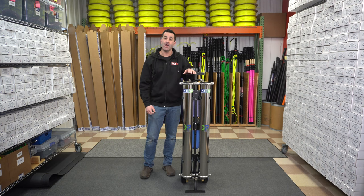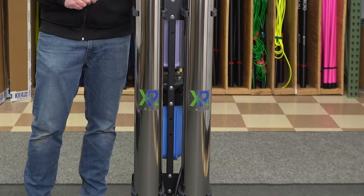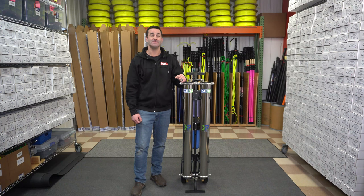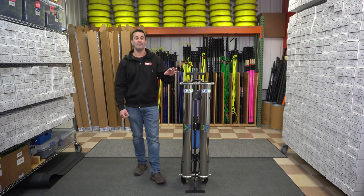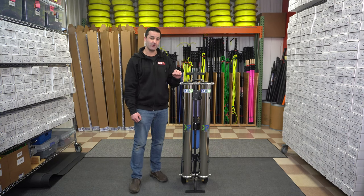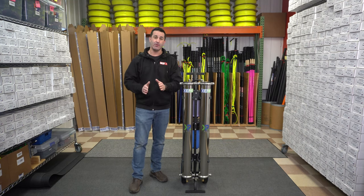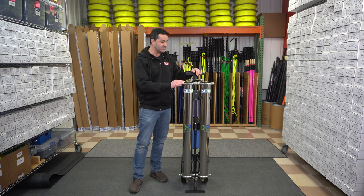Alex with windowcleaner.com, here with the XPR or Zero Pure Revolution Max. This is a dual 40-inch RO membrane unit, which means it's going to put out twice the water of the XPR Zero Pure Revolution because it has one more membrane — same exact size. So you're going to get exactly double the water out of this dual RO system.